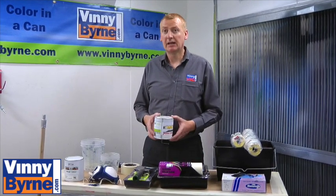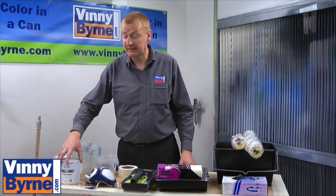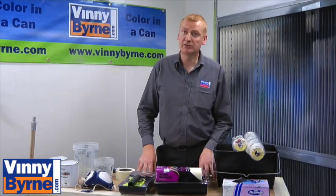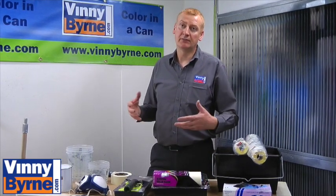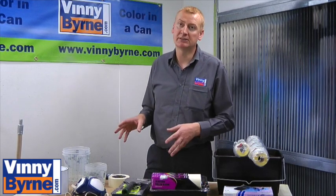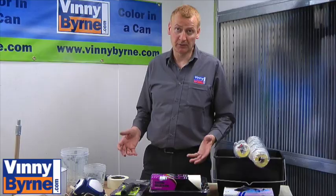It's very easy to use and straightforward. After that we would have what we call 2-pack paint. In this case we have a 2-pack epoxy paint, which has been designed more for commercial use or for heavy traffic use. So if you were driving cars over it, or if it was in an area where there was going to be spillages — chemical spillages — you'd have to look at the 2K epoxy paint, which is tougher, durable and will last a lot longer.